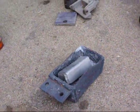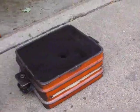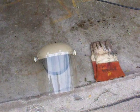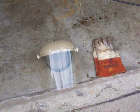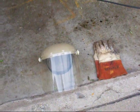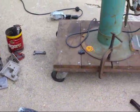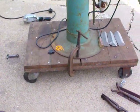A couple words of caution. We've got hot metal and when it turns into molten metal it's very dangerous. Make sure that you wear a full face shield, leather gloves, and anything else you might need to protect yourself. Keep the children away. Remember, no water anywhere in the vicinity of casting or molten metal because it'll turn to steam and explode.